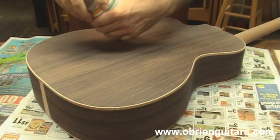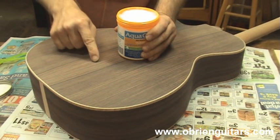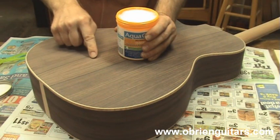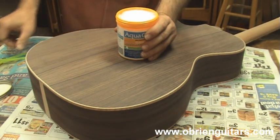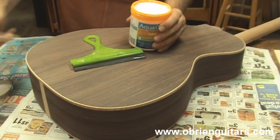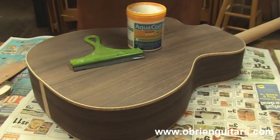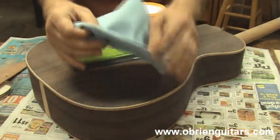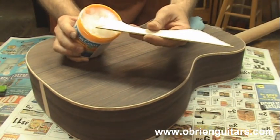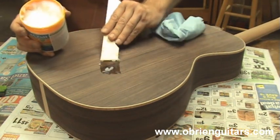Here's my product. What I've done is sanded my guitar up to 220 grit, and I've removed all the dust from the pores — I don't want anything impeding the product from getting into the pores and filling them. Now to apply it, you could use a little rubber squeegee, a plastic Bondo-type spreader, or to make it really easy, just a paper towel. I've also made a super high-tech little spatula here out of a cutout for my spruce top, and I can just reach inside the pot of product and wipe it on.